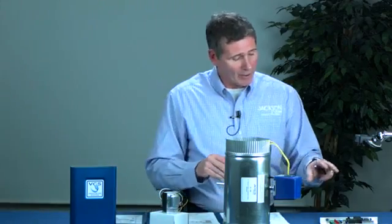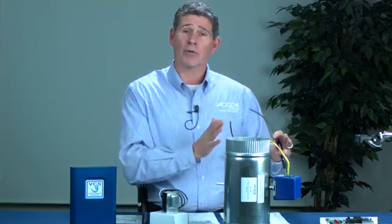One thing our system does that separates us is that we don't just open the damper and start dumping air into the home. Say the house needs 30 minutes worth of fresh air — our panel divides that in two. So it needs 15 minutes of fresh air in the first half hour, and an additional 15 minutes in the second half hour. What's really unique is we don't just open up the panel — we actually wait for the system to call. That way, when you're bringing fresh air into the home through the return, it's actually going to become conditioned air. We just don't bring in air all on its own; we wait for the system to call.